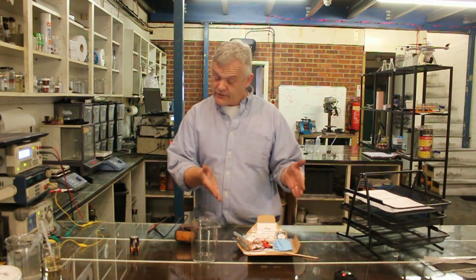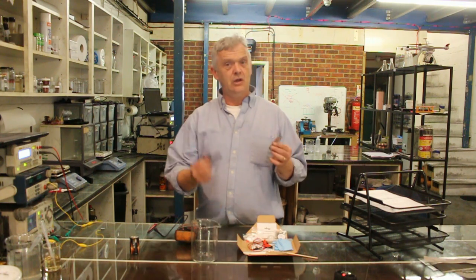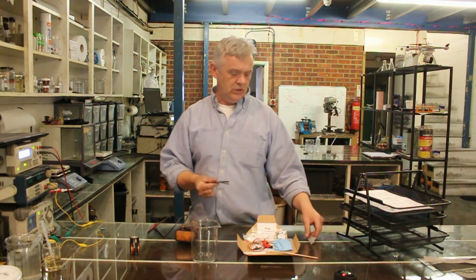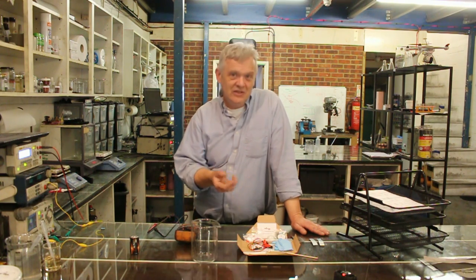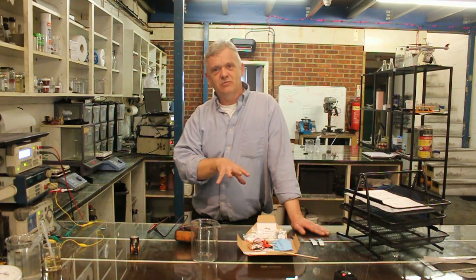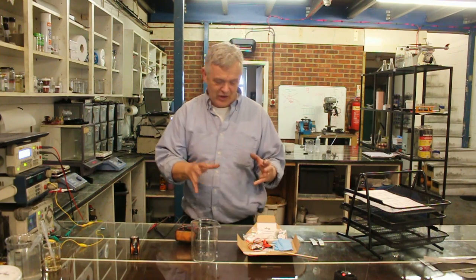The kit has just everything you want in it. The current collectors are going to be zinc and graphite foil — so we provide you with some zinc and some graphite foil. It's going to be the anode and the cathode. What we need to do with that is put an active material on there. The active material that we're going to create is zinc hexacyanoferrate. You can't buy zinc hexacyanoferrate — you have to make it. And when you make it, we want to make nanoparticles. So we're going to make zinc hexacyanoferrate nanoparticles to use as a cathode material in our battery.